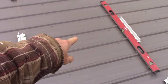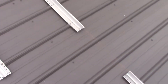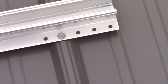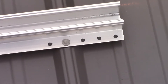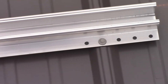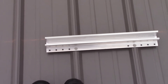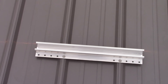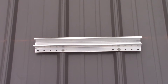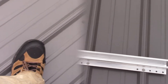The rib pattern went two, three, two, three, two, three, two, two. The way it worked out best was using the fourth hole of each bracket — that seems to center the bracket on the nine-inch ribs. Those holes are set up to accommodate different styles of metal roof panels.